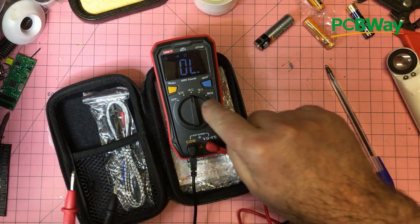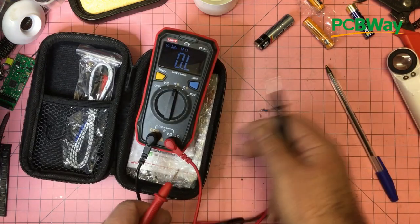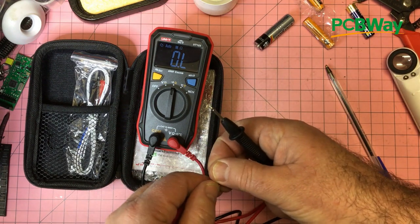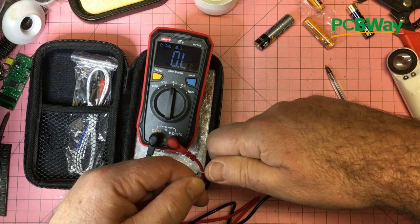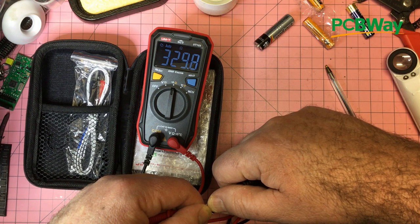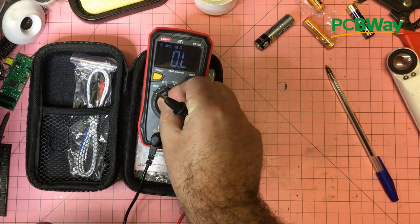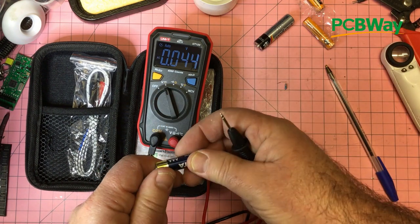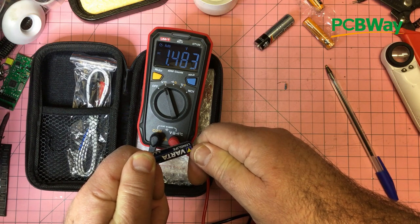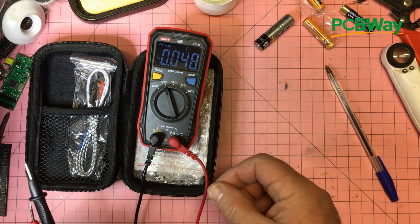Let's see if we can't — okay, it's on auto. Here we've got a resistor sitting by just for the purpose. I'll put that in — auto-ranging — and that's a 330 ohm resistor, so yep, pretty good. In terms of voltage, let's have a look — this should be around 1.5 volts. Yeah, 1.483. I was just looking for another meter that I didn't have to find the range for.